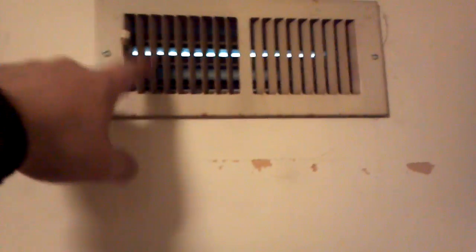Used my tubing bender — made some nice gradual bends for the line set. This room is only four by five feet, so we have a water line behind the water heater and behind the washer and dryer. There's a four by ten barometric pressure relief damper in here to help get some more combustion air for the furnace and water heater.